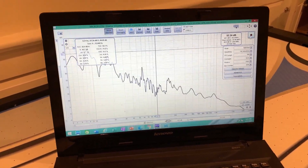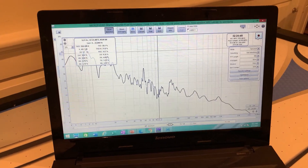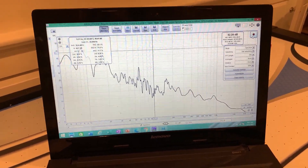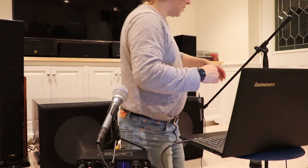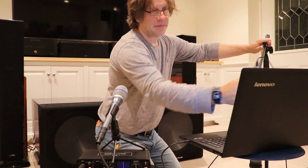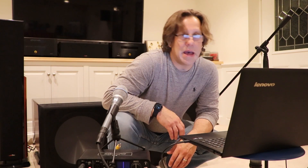It's amazing. We're directly below here, right where the computer is sitting upstairs, and that's transmitting down into the basement to really be pronounced — I can hear it and I can measure it. It just shows the impact of everything in the house on the system. We're still getting the 60 cycle hum, and I'm curious if I put this microphone close to this laptop. I turned the refrigerator back on and it hasn't caused a problem, and the air conditioner is back on. Don't see that 99 Hertz — that was definitely 100% the Mac upstairs, but I still have around 60 Hertz.